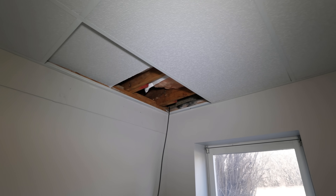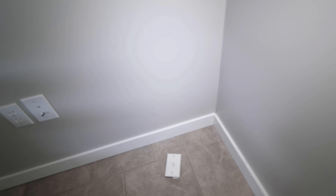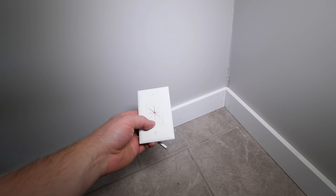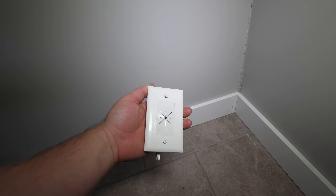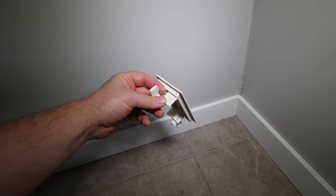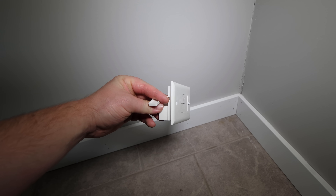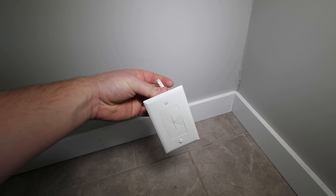So I've got the line on the inside here, kind of all coiled up. It's a drop ceiling on this side, but the side I want to install on is a finished ceiling. So what I'm going to do is drill a hole in the top plate from the other side and fish the line down to about here, then use one of these fancy cover plates. It's a rubber grommet so I can pass the wire through it, and what's great is you don't need a receptacle box in the wall to install it — it has clips which pinch the drywall between the plate and the clip, and when you tighten the screw it holds the plate in place.